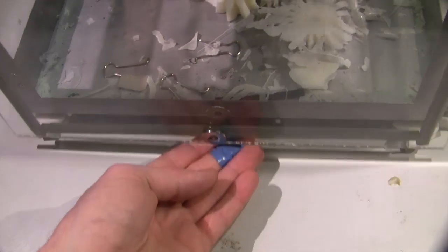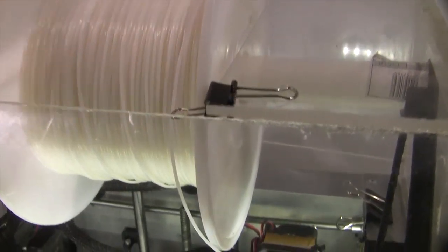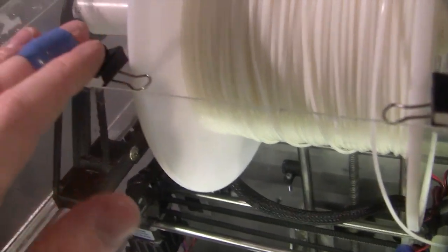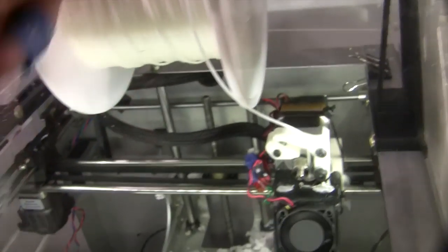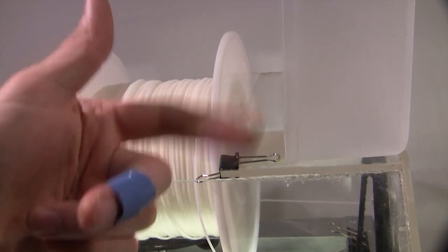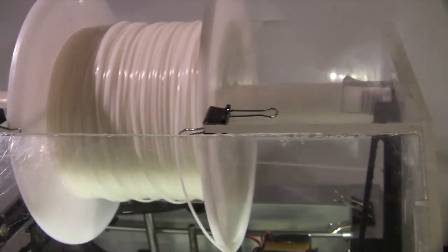So that's my enclosure, which is all held on with magnets, and I've got these. I had to build these extra bits onto it because of the other carriage that I've printed, which I'll show you in a second. And I printed these spool holders that the PVC pipe just clicks into the top and just locks in. And I've had to use a couple of these office clips, or whatever you want to call them, to keep the dust on there. A bit of fluff. I've used these office clips to keep the filament from popping over the edge, especially when it's a fairly full roll. It gets over the edge and then starts winding around the spool holder. So these just act as guides to stop it from flipping over.